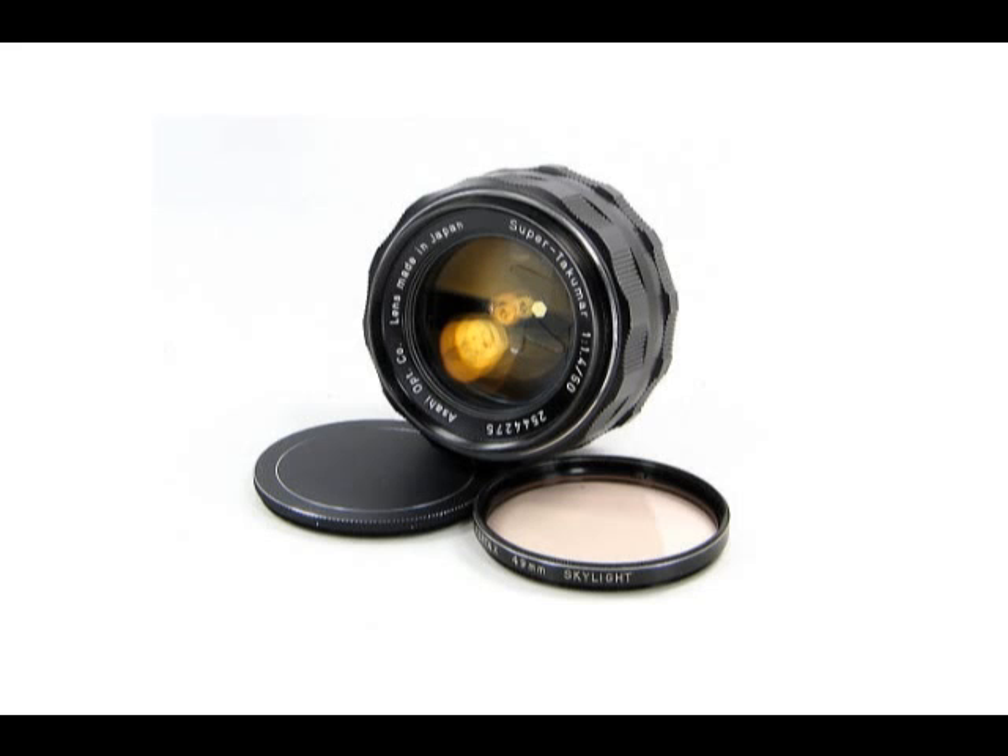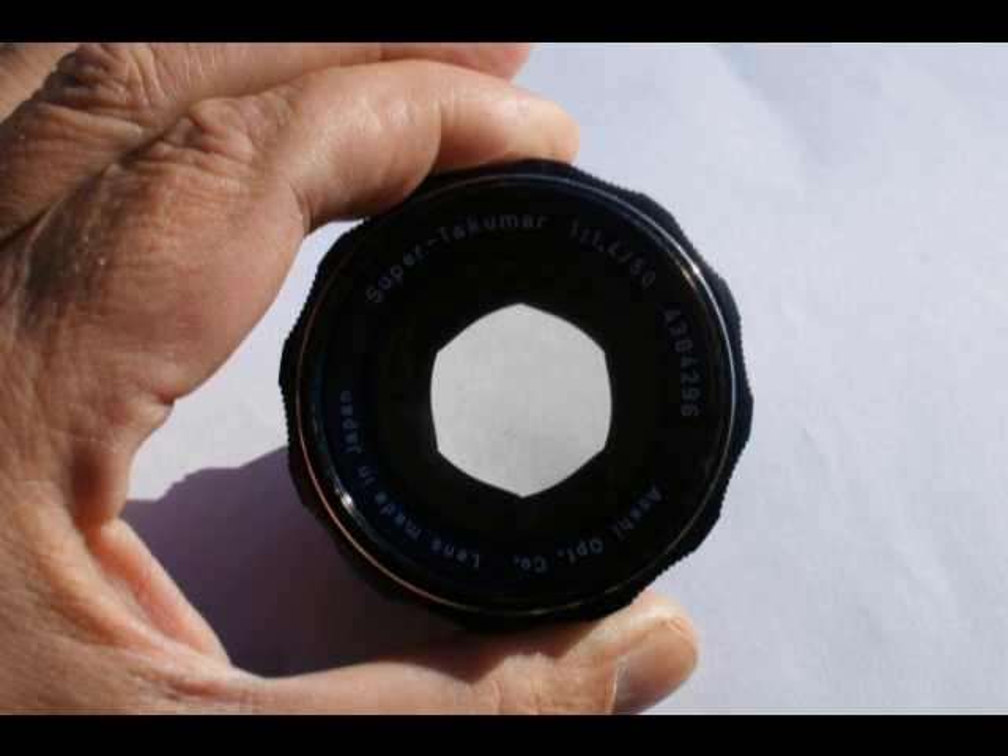This is not to be confused with the golden color reflected off the front of the lens, which is due to the lens coating — typically magnesium fluoride or other compounds deposited by vacuum to prevent reflection. That coating is normal and will transmit colorless light. Here we have a lens that has been treated: holding it over paper at wide open aperture, you can see the light transmitted is colorless, whereas the untreated lens previously showed a yellow tinge.